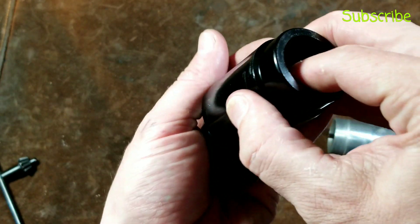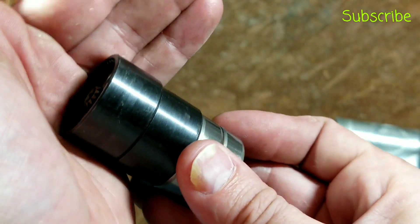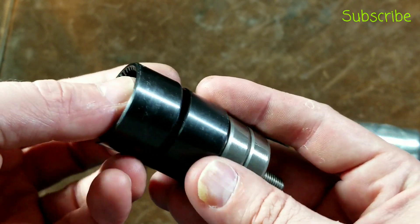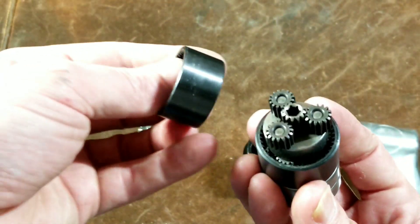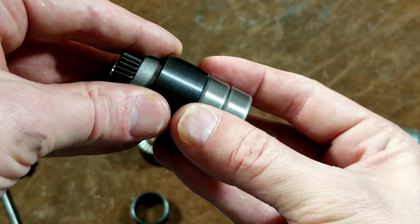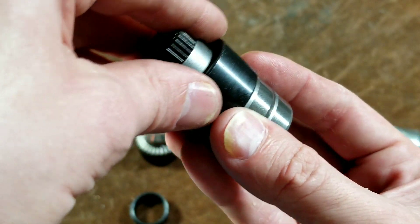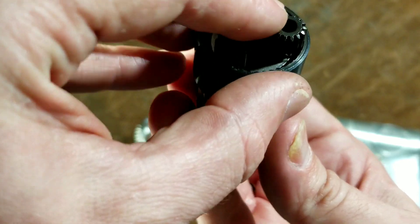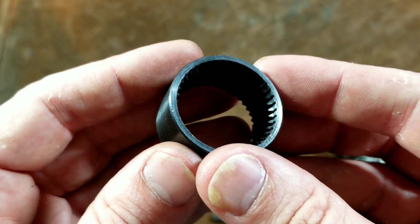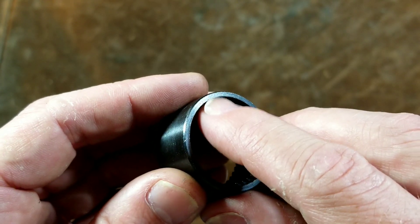Furthermore, if we pull this whole stack out of here, you can see there are the dual ball bearings. The ring gears are actually split — they're not even one continuous ring gear for both stages of the gearbox. They're split ring gears, and so they want to slip against each other. What prevents the bottom one from slipping is purely from it being against the back of one of the ball bearings. But you can see one of the issues is that it's larger than the rim of the ball bearing, and the ball bearings have a little bit of a taper on their edge. If we pull off this second ring, you can see it has a very thin edge on it too, so it's only seating just by a little bit on that back ball bearing.